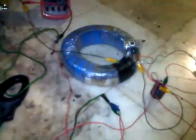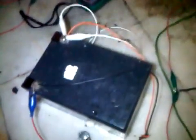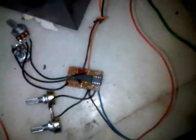It's running off my PWM, which is currently configured as a buck converter. This is my high speed diode, and this is my inductor which is a normal copper wire. This is the amp which flows through the diode, which is about 3A. This is a cap which is directly connected to the wall plug which is being rectified. And this is my ballast. And this is my fuse, which is a very thin, refined soldering wire.